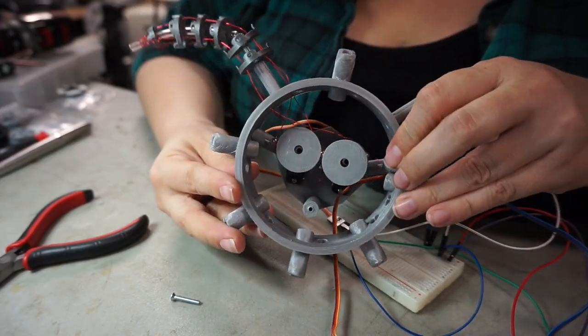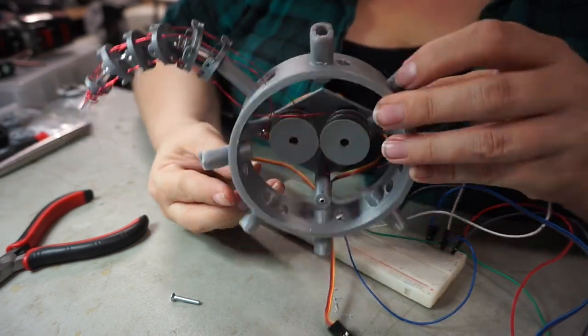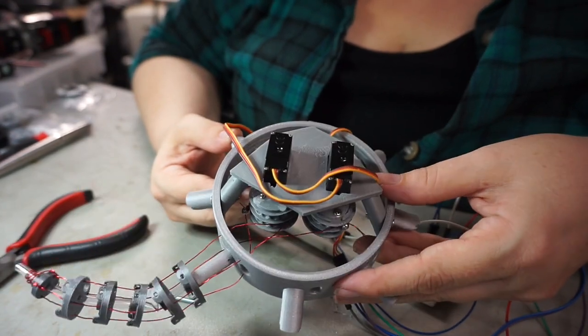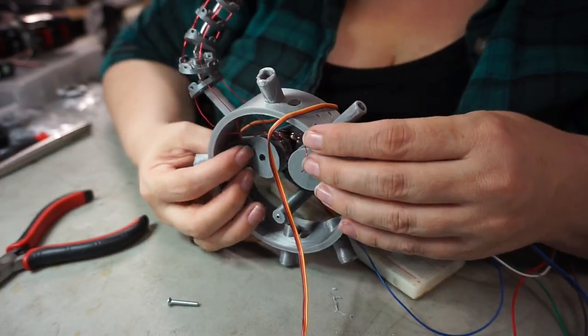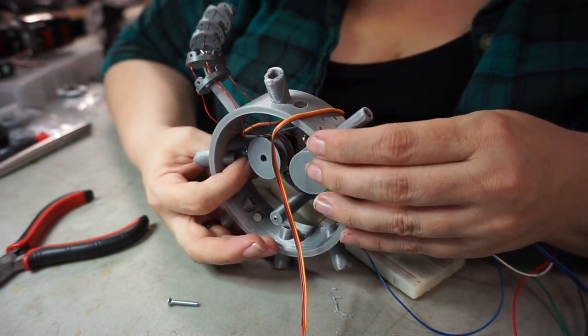The chains are inclined to slip off the drive wheels, which isn't exactly a desirable trait in a complex mechanical creature. I think I need to either adjust the location of these pulley wheels or make tunnels to guide the wires to exactly the right position, or both. An alternate mechanism that might be less inclined to fall off is something closer to a bicycle chain and sprocket, but I'm not certain that that would actually be easier to create in this little space. So I'm gonna play with this a little bit more and see if I can get it more reliable.